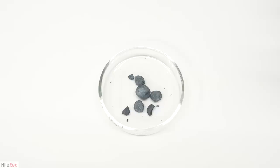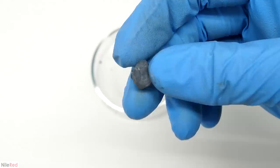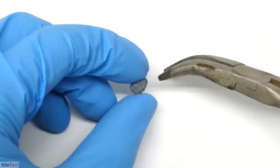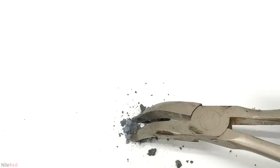When they were dried, they looked exactly like little rocks you'd just find on the street. The only giveaway is that because they're made of lead, they're really heavy. Also, because it's just made of weakly compressed powder, it lets off a lot of residue when it's touched. I then tested its strength using some pliers and it just crumbled into pieces. What I have here is a mixture of lead and zinc, but it might be a useful way to make lead powder — if the lead sponge were first soaked in hydrochloric acid before squishing it down, the zinc could be pretty easily removed.